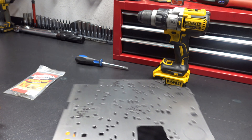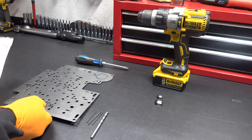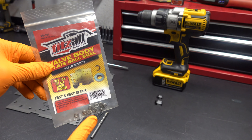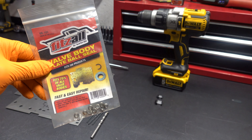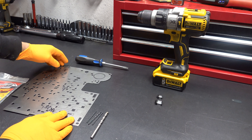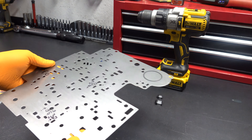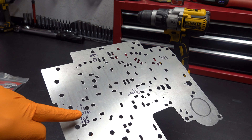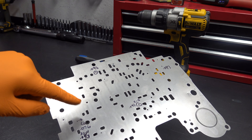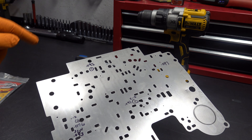There's a kit you can buy — it's made by Fitsall. What it basically is is a package of repair sleeves and little retaining rings or snap rings. What you do is you drill out each of the holes that are worn. Take a 1/4-inch drill bit and drill out each of these holes — here, here, and here.